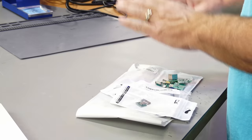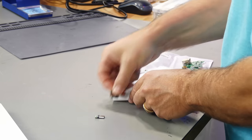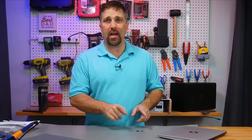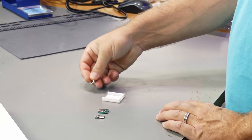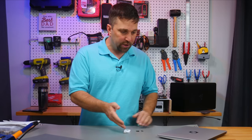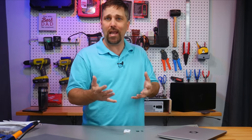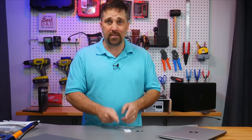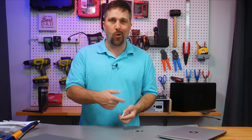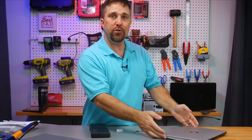Let's start with the magnetic charging card because I think this one may go to plan, which is simple. I have a male and female USB-C connector which I'll solder together, then I'll get on Fusion 360 to tweak the enclosure to hold everything and allow me to recess the magnetic Type-C charging port into the adapter so it's flush with the laptop. I'll let the camera run like Adam Savage's one day builds and stop occasionally to fill you in. First step: figure out how to fit and secure the components, modify the enclosure with compartments, and get Fusion 360 fired up.